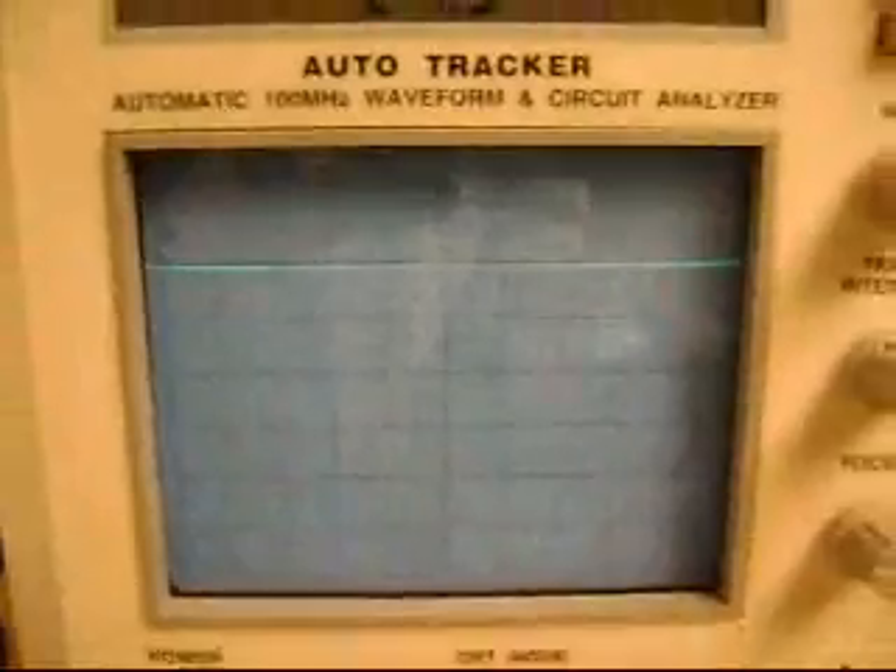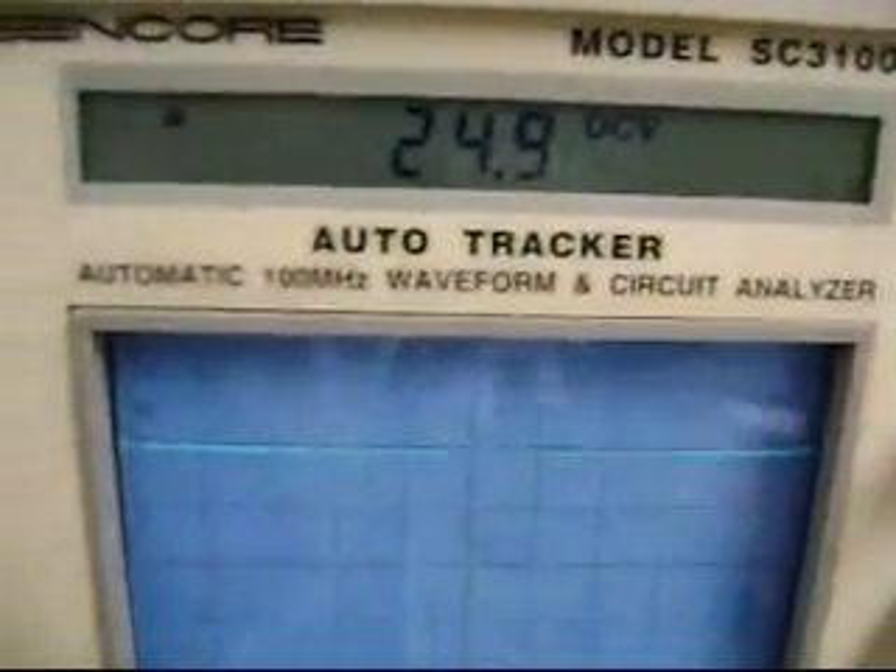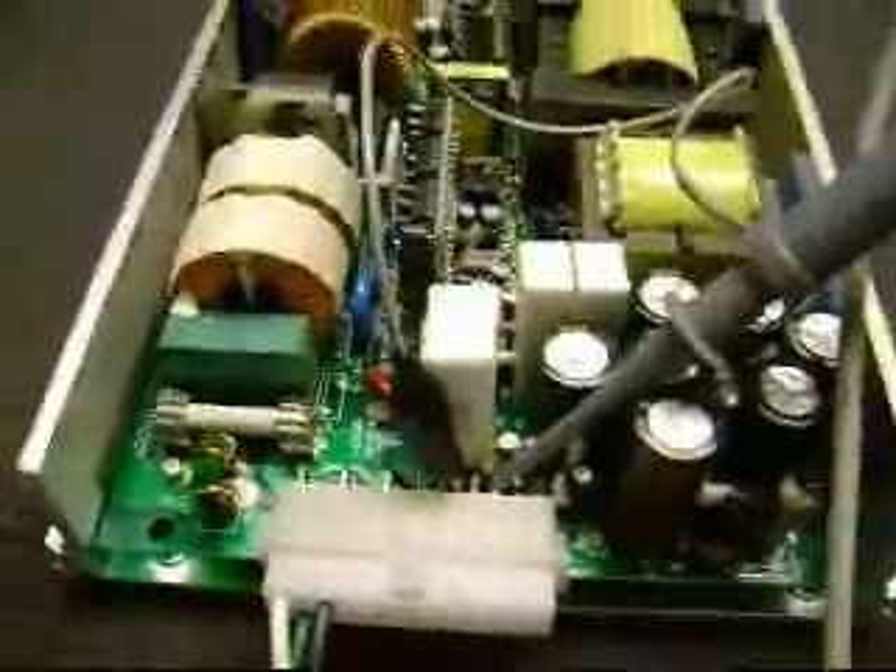However, if I go and check the DC outputs, you'll probably find they are actually there. If I'm checking the 13-volt output on DC, you can see I've got like 12 to 13 volts — that's all groovy. And if I move over to the 25-volt output, there's 25 volts. I'm on 5 volts per division, so 5, 10, 15, 20, 25 volts. So you might be saying to yourself, hey, this power supply is good — but it's not, because it's missing this output at pin 7.